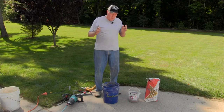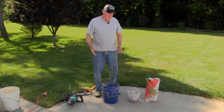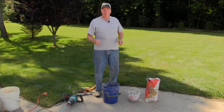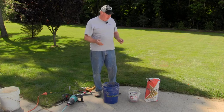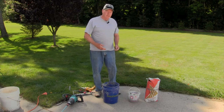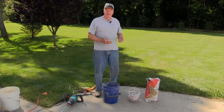It's the pail — how to stabilize it, how to prevent it from turning and tipping. The newest mortars on the market today have a very low water-cement ratio. A 50-pound bag of material only requires five pints. This is a very stiff mix to start, until some of the dry ingredients kick in and relax the mortar.